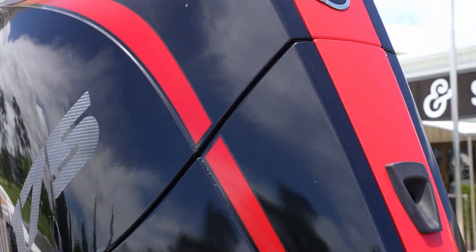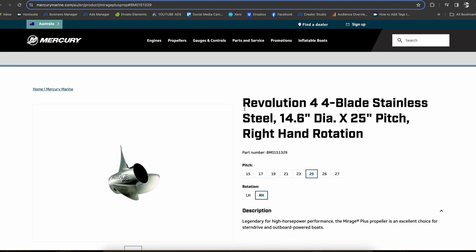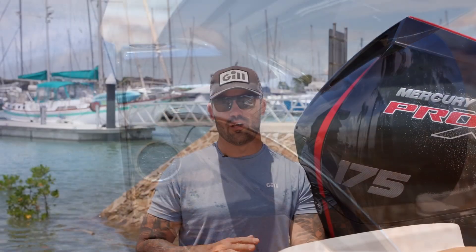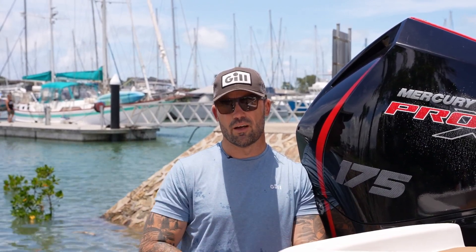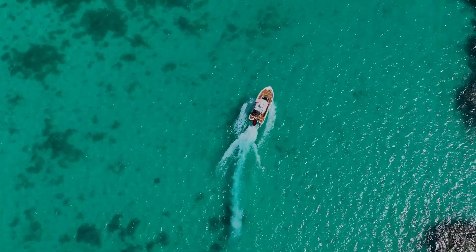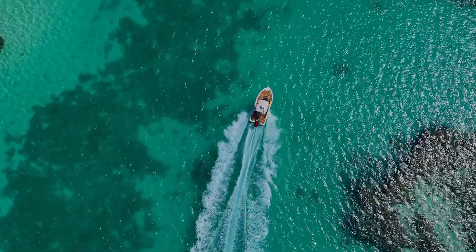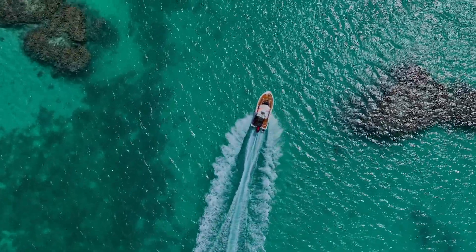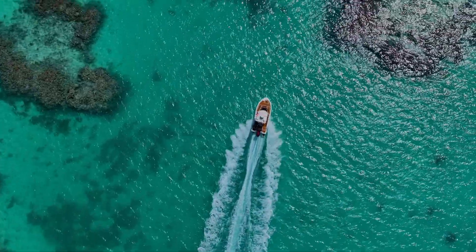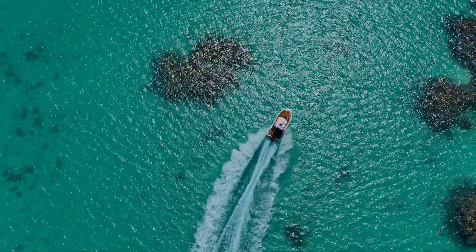After chatting to my local dealer and using the Mercury prop selection tool, I landed on the Revolution 4 — a 17 by 14.5 pitch prop, which is a larger pitch but smaller diameter. The key thing for me with the Revolution 4 is that it is a stern lift prop, so it lifts the stern rather than the bow, which is ideal for my setup. Since switching to the four-blade, I can cruise at lower speeds on the plane, get on the plane quicker, keep the nose down, and actively use my trim. I rarely use my trim tabs anymore, and not using trim tabs is also a plus for fuel economy — pushing them down adds load, drag, and more fuel use. I now use them purely to correct sideways swell or crosswind motion.